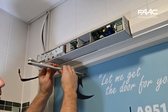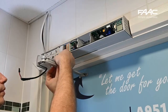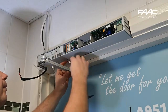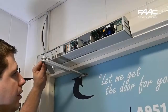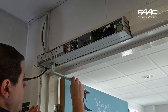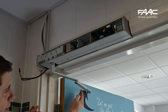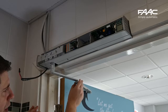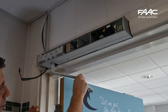Then the two parts of the arms are attached together. There are two bolt-head screws that secure it from above so they're not visible. I would always recommend using the two outer fixing holes. Once they are in the right place, tighten up. Check that the door movement is correct and the arm is not going too straight — when fully open, the arm should always have a kink. If it is too straight it might not function correctly and could go over itself.